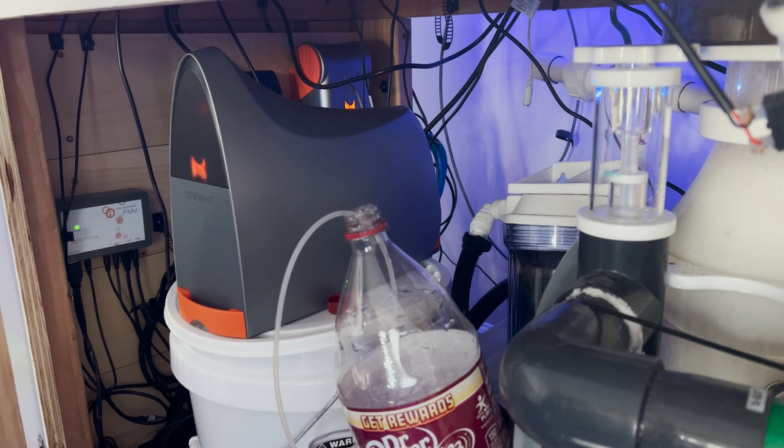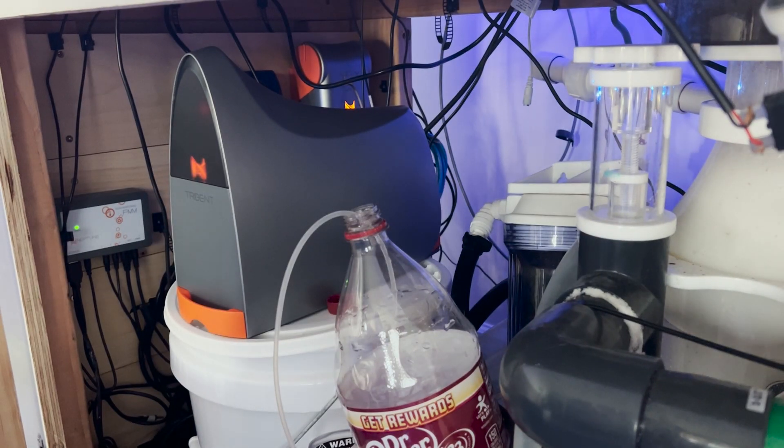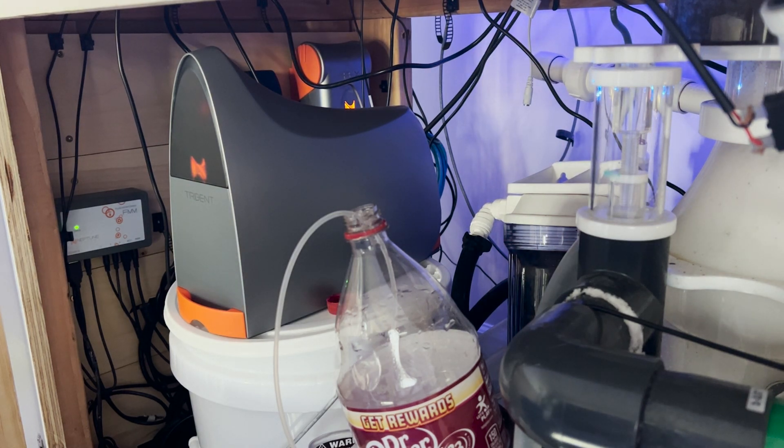Select your Trident. Now you need to enter the values printed on the calibration reference solution. There's the screen and there are my numbers, so I've got to enter those in. We are at 8.3, 440, and 1345. The solution does state that once opened it is accurate for eight hours, so once you open this you've got to use it within eight hours — probably due to the chance of evaporation.